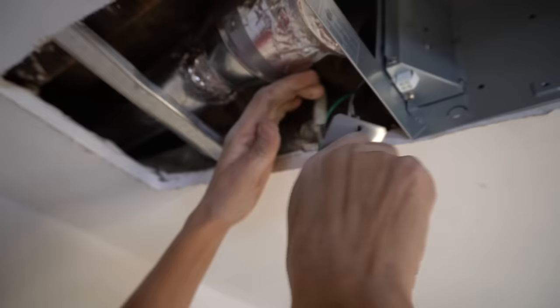Before we can slide our motor into the housing, you'll notice two channels on the side — line them up, then gently push up. You have two screws; put your screw in there and tighten, then do the same on the other side. Then make your connections so we can operate our fan. Slide that in, line up your squares, and push up. At this point, we want to give this a test by turning on the switch — let's see if we have some action.